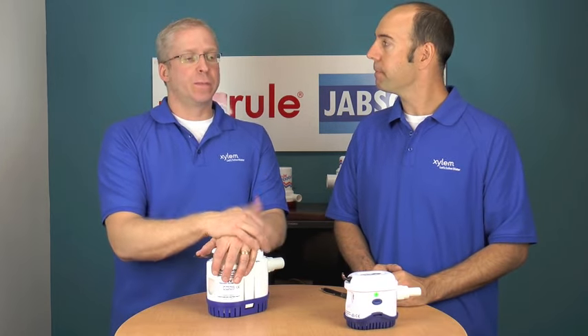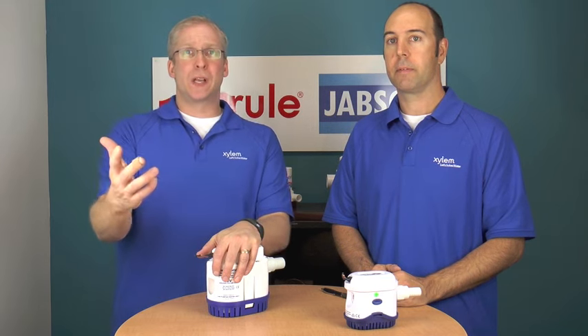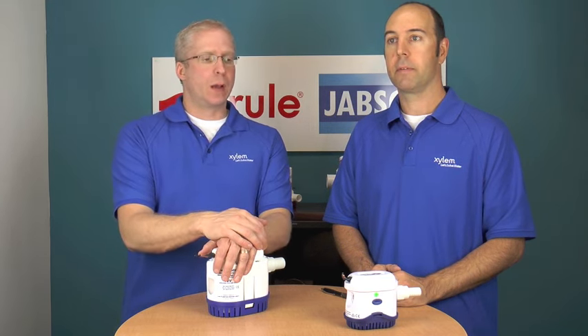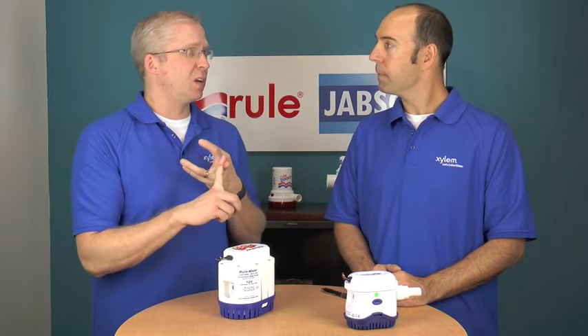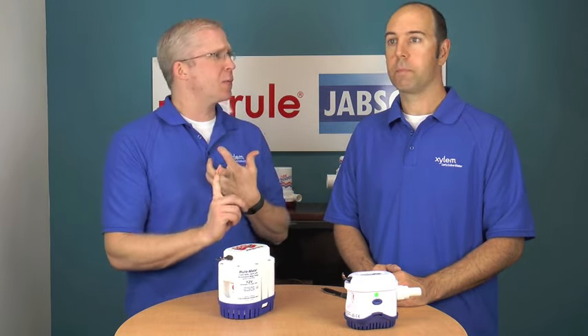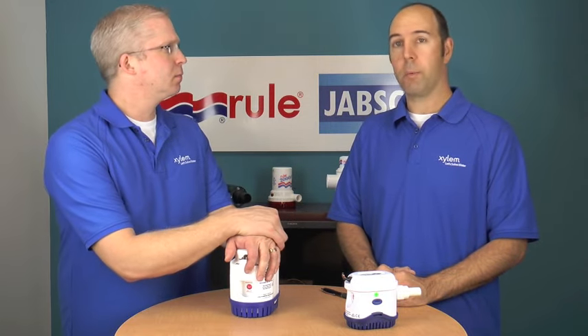It's pretty simple — clean up the sensor to get it back into level sense. We hope this helped you out. Key points: clean the sensor, disconnect power, and all you really need is a rag and a little bit of soapy water. Soapy water cleans it right up. Thanks for watching this episode of Jabsco Tech — see you next time.